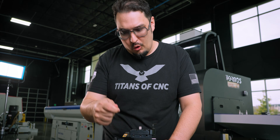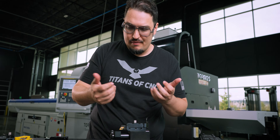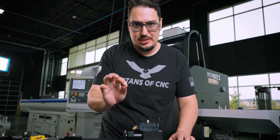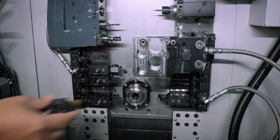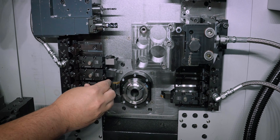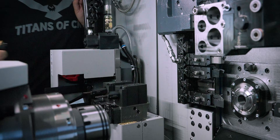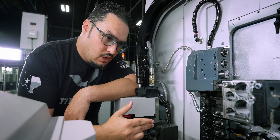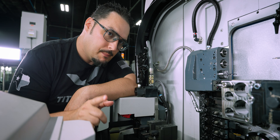And then you can look at the old one, see what's wrong with it, change the insert if you need to, and just have it ready so that you have as little downtime as possible. When you're running a complex Swiss job, especially high production ones, this system isn't just convenient — it's money. The tools just snap in perfectly each time. If you need to change an insert, you can just swap out the whole tool. You have one already preset, you're good to go. You can change it while the machine is running — your setups become automatic.